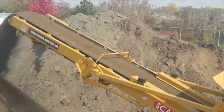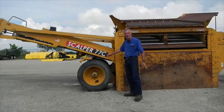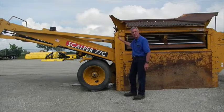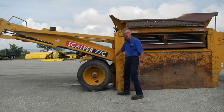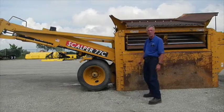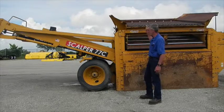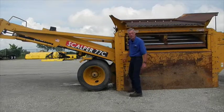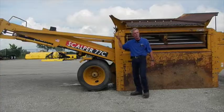The conveyor is a three-foot fixed-height conveyor and the material exits off the end. This axle here is hydraulically operated using the control levers shown earlier — it goes down and raises this end of the box into the air for transport, and has a couple of lock pins that go in to hold it in the transportation position. If you need a higher elevation and have a loader tall enough to feed it, you can raise this up and put timbers or something underneath the base of the machine to achieve a higher loading height.